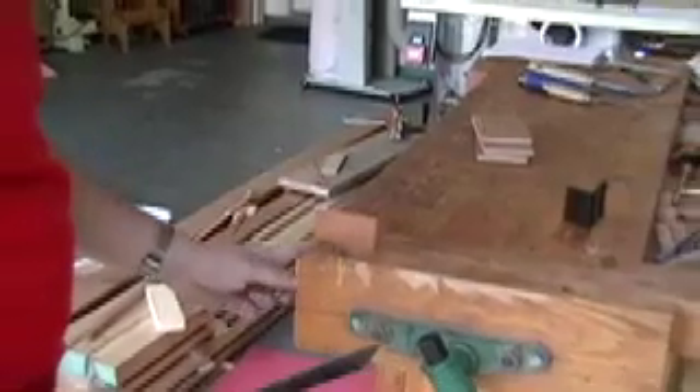Now I'm going to start cutting. What I usually do is cut first all the angles that go one way and then all the angles that go the other way. You have to get into a routine — always do things exactly in the same way, exactly in the same order. This is the way you get very consistent cuts and produce good quality dovetails. I'm not going to be overly concerned about going straight on the line; the line is just a visual aid to cut straight down. Notice how I'm using my left hand and the thumb of the left hand to guide the saw initially.